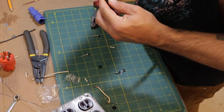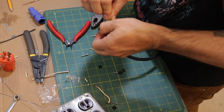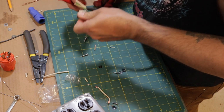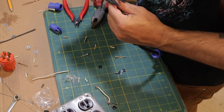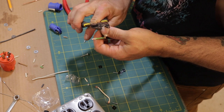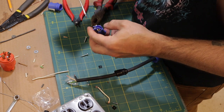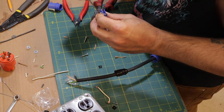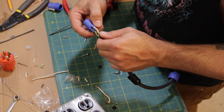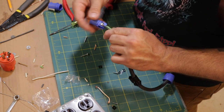This is just a 14-3 electrical cord that I have laying around. You can probably find an old extension cord from your dad's garage or grab one from another trade on the job site — it's perfectly acceptable. You don't necessarily have to solder these, but again, they're going to be used and abused quite a bit, so I always do. There are really two ways you can solder this: you can either pin them down and solder after the fact, or you can unscrew it, take it out altogether, and throw the whole connector in the solder.